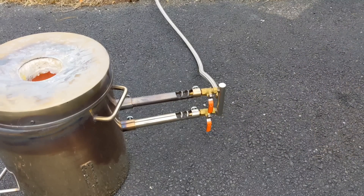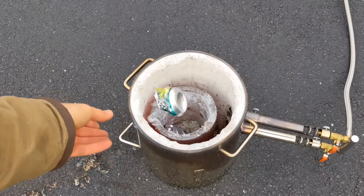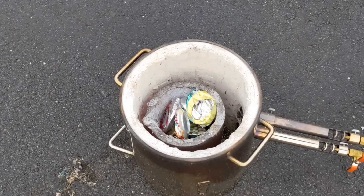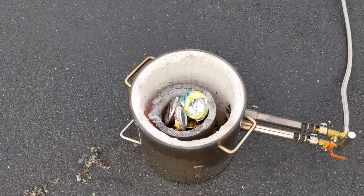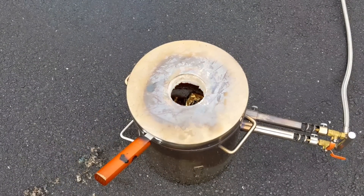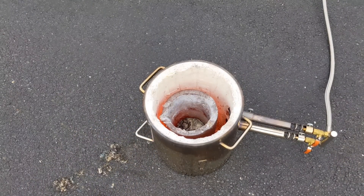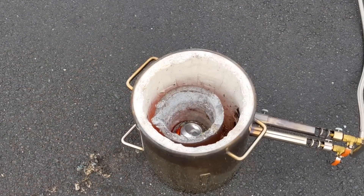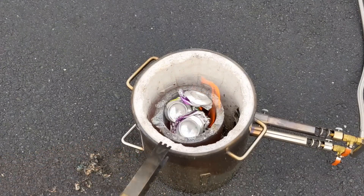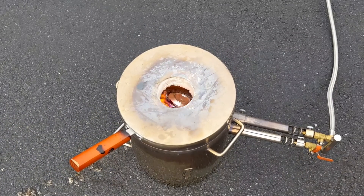As you can see the aluminum has already started melting down — it's probably been about ten minutes, so it's time to load the crucible with some more aluminum cans. In the beginning of doing the aluminum can melt it does take a while, but once you get a puddle of molten aluminum in the bottom of the crucible it goes much quicker. You can basically just push a can directly into the molten aluminum and it will almost melt it instantly. So guys please sit back and relax and watch a super cool relaxing video of melting down some aluminum cans.